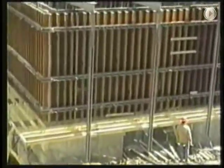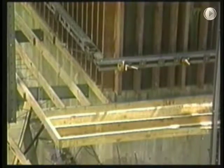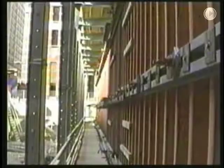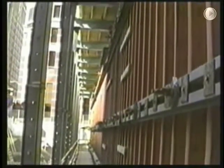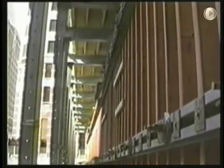This scene shows the walkways the contractor will install in the field on the brackets provided. These walkways completely encircle the form for safe access for the workers. The channels from which the walkways are hung are set back about three feet to allow the forms to roll back off the concrete to clean and oil the forms.